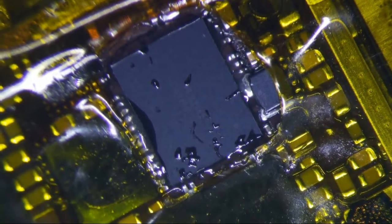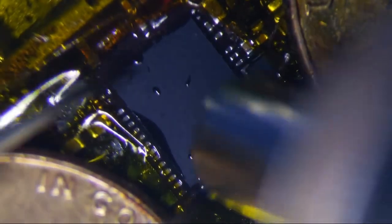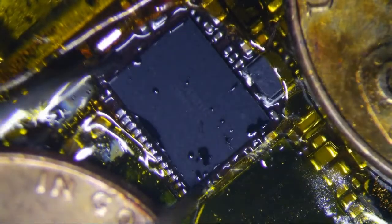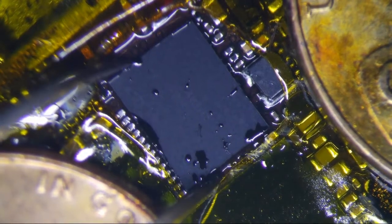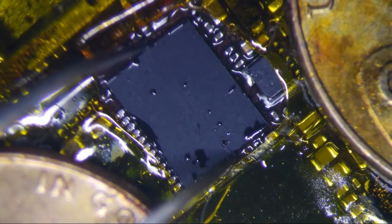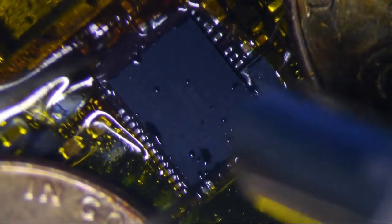So heat slowly, okay? Let's get your penny heat sinks again, and just kind of melt a little bit of it because I think I put a little too much flux on there. It's no big deal, but okay, so that moved again real quick. So it's just like that, okay. I think that's pretty good right there.